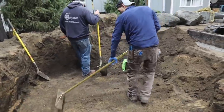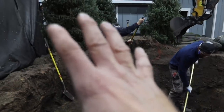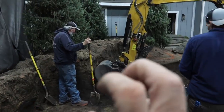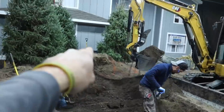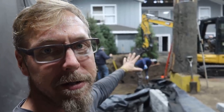We'll put a couple accent boulders in through here. Where Josh Duffy is standing is where we're going to have the outermost section of our stack slate urn collection - a trio of large urns, a trio of medium urns, and a surprise jumbo urn way back there. We're going to have to seam some liner together, attaching this piece to the one holding back the dirt and water in the urn area, and probably seam another section for the main rectangular pond section.